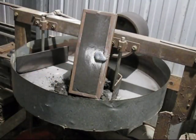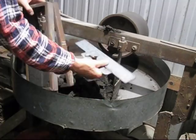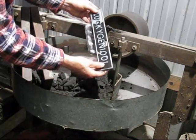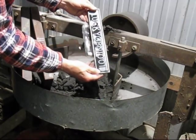This is the last casting I poured when I added nickel to the iron. We'll see if it filled up the mould. Yes — look at that. No vents, and it filled up the mould no problem whatsoever.